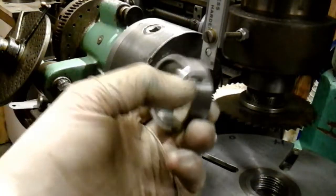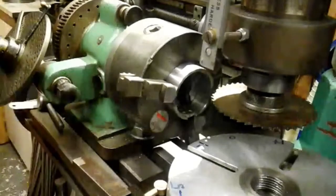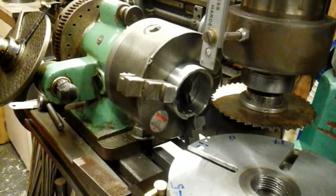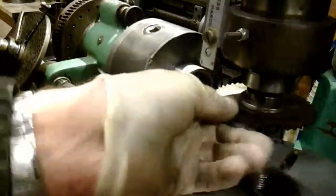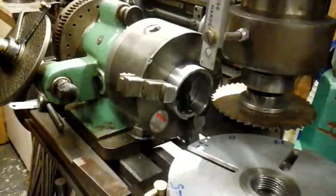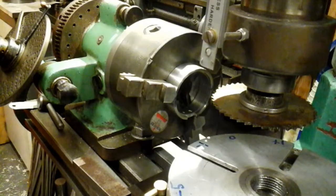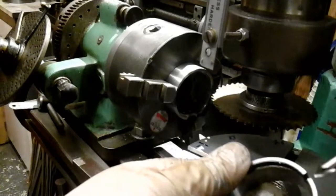This slot here is going to be a quarter inch deep. It's just a straightforward slot. I can't quite recall the width from the drawing — approximately 100 thou wide. My cutter is only 3/32, which is 90 thou, but I'll get round that shortly by showing you when I put the angle on. I've got no special cutter. It's a 60 degree angle, and all I'm going to use is a broken centre drill that I had saved — it's the exact angle that I need.